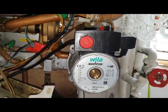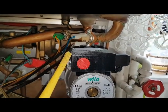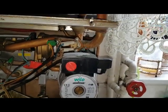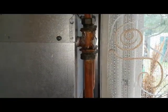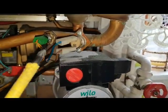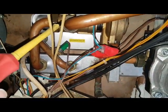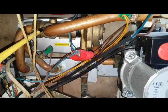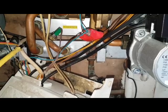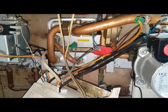This is your pump. You've also got your central heating thermostat and the overheat thermostat. The flow of heat comes from the main heat exchanger, comes down, passes through these two controls into the diverter valve. So that's the flow pipe going into the diverter, carrying on down and out to the radiators. That's the passage of the heating circuit.